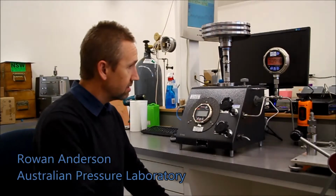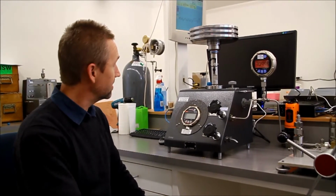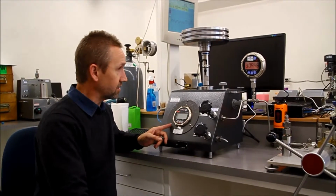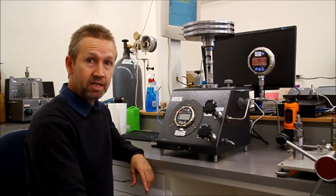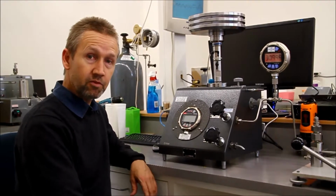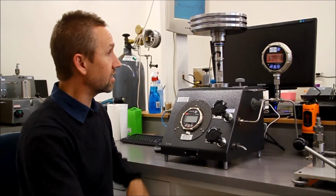Hi, this video is to demonstrate how to operate a Model 80 DH-Budenberg deadweight tester, a pipeline deadweight tester. Only this one has been configured without a mechanical pressure gauge for indicating pressure loss in a pipeline, but instead with a crystal digital pressure indicator which will attempt to do the same thing, but without some of the problems that could possibly come from a mechanical gauge being overpressed and being offset from zero through shipment and the like.